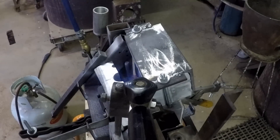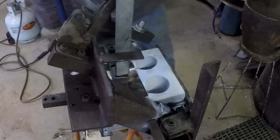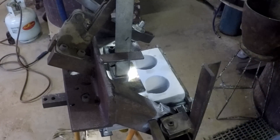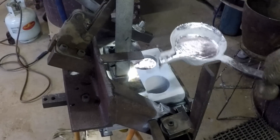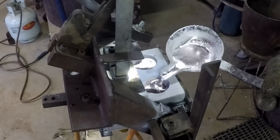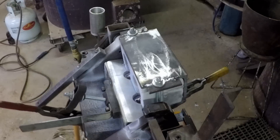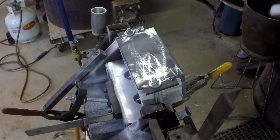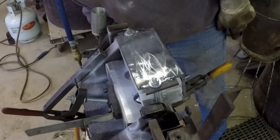Right, the metal's all fluxed off, clean, hot enough — I've got just up to 740 degrees centigrade. I think that's good to go. We'll remove the torch. Very awkward to film this because everything moves. Right, first pour for the day as they say. That looks pretty good!